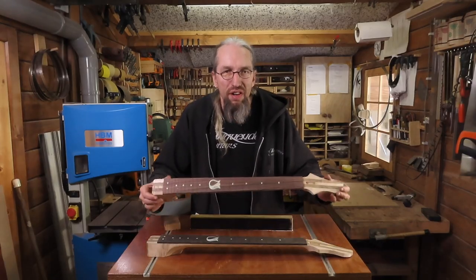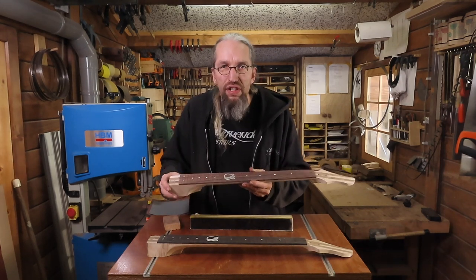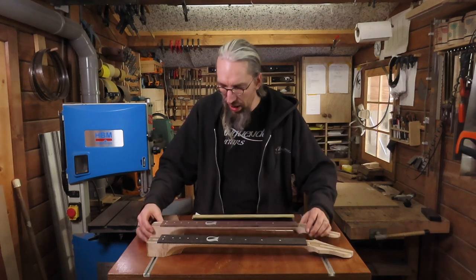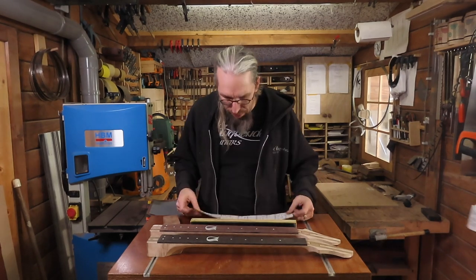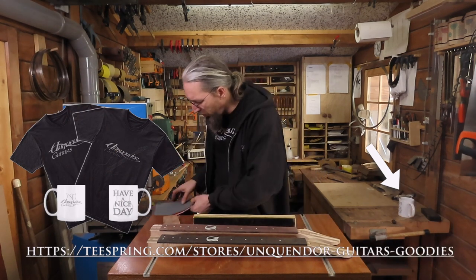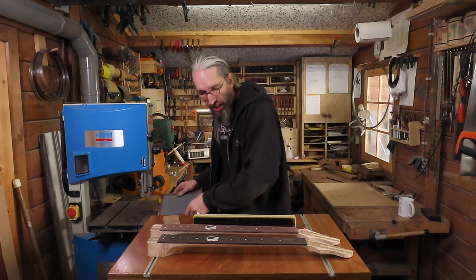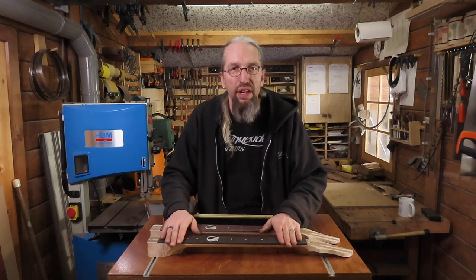These two necks are coming along nicely, and after having done the fret position markers, I took out my leveling beams and made sure that the two fretboards are now absolutely dead straight. I have only a single pass to do, and that's with 320 grit sandpaper stuck to my long leveling beam, and give them a final sanding before starting to polish the fretboard with these high grit sandpapers, starting at 400 and ending somewhere around 2000, I guess. So the fretboards will be nice and polished before putting in the frets.